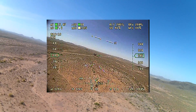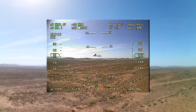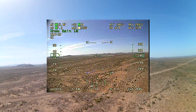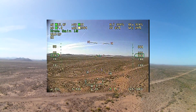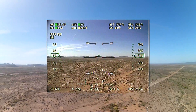But I'm still getting some oscillation. There's another value to check, and that's the alt-hold value. I'm going to try and take this out of 2D hold and just put it in 2D mode and see how it does, because that should get rid of the alt-hold gain. So just putting it in 2D mode - that should just be pitch only.